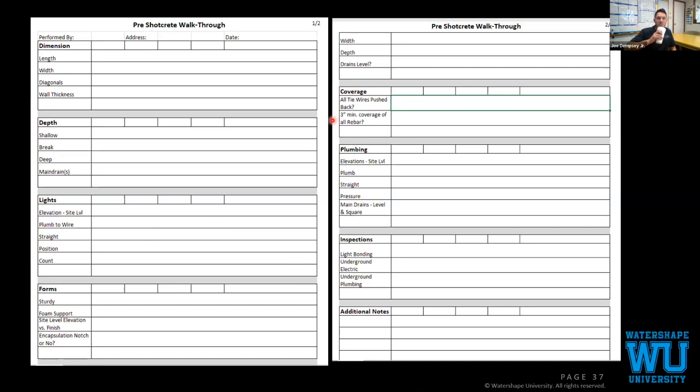The other thing to remember when we're doing a movable floor is that the system's getting built overseas. So we don't have room for adaptation because it's usually getting constructed at the same time, right? That product's being manufactured to the strictest tolerances. The product in the field has to match those tolerances. We're going to ship all this stainless steel that's been passivated and designed to go in underwater. It has to match when we get there. So the time it takes after this stage to make sure it's right is critical.